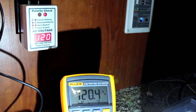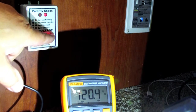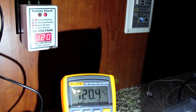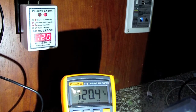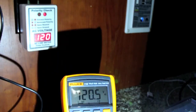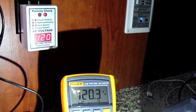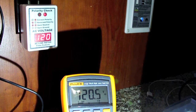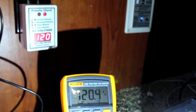One thing you have to be aware of with any digital meter is the last digit — whether it's a whole volt or a tenth of a volt. There's something called a hysteresis error in which the last digit can be off by one digit. For example, if this were reading 120.5, it may actually read 120 half the time and 121 half the time, because that half a volt can go either way between 0 and 1. So the advice is: don't sweat the last digit so much.